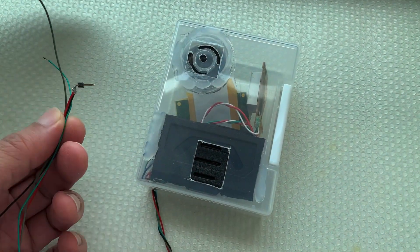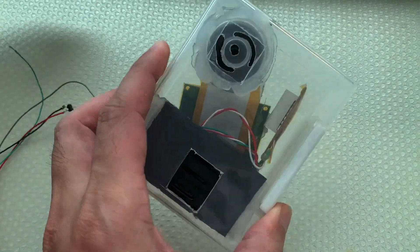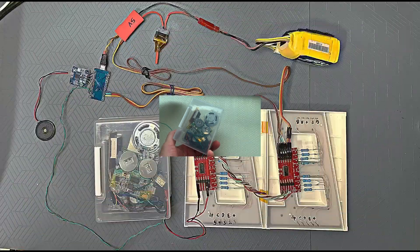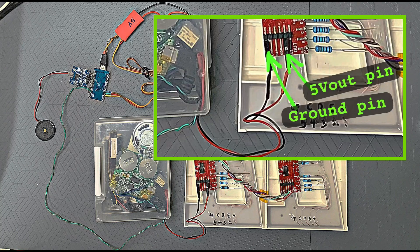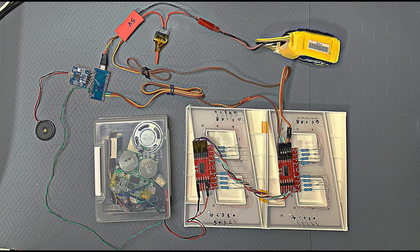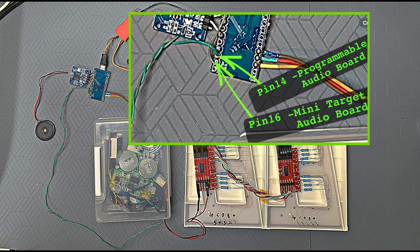I've done up the wiring and here's the completed sound box — looks pretty neat. In this shot we have the final completed wiring for all electronics. The only changes from before are this pair of wires which tap 5V from the output pins of the SparkFun board, and pins 14 and 16 which are used to control the relay switches for the two sound systems respectively.